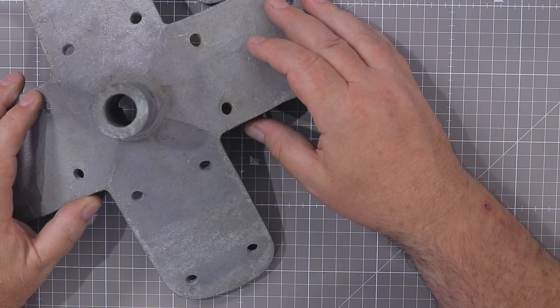I remember doing experiments before — one reason the SteppIR on 20 meters is interesting is the element spacing on their two-element design. If you get the spacing just right on a quad, you can get the impedance to 50 ohms naturally. You might lose maybe half a dB, but you'd lose that anyway from all the extra coax, connectors, and hassle of the 75-ohm route. Wouldn't it be fun to hit 50 ohms naturally with just a choke at the feed point? They're going to clear that field in the next couple of weeks.